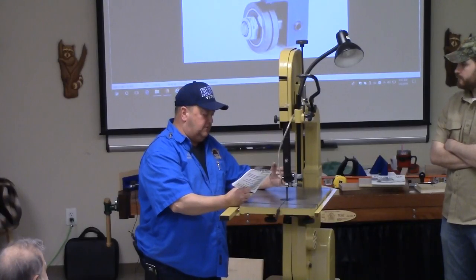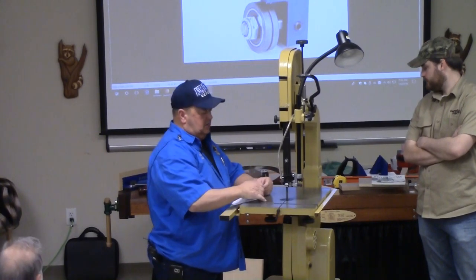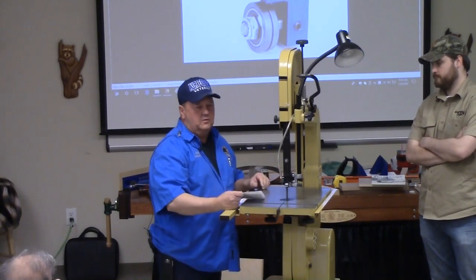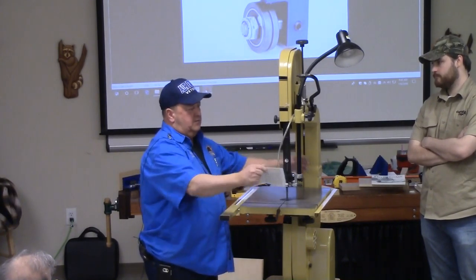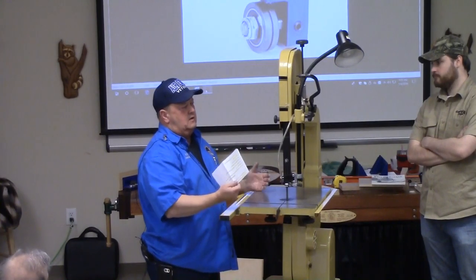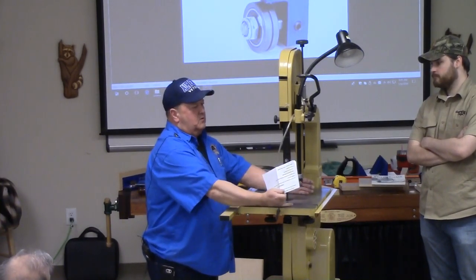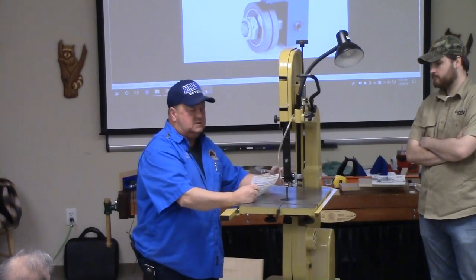For bandsaw safety, I use push sticks for everything. If I'm running something across there, like a 2x4 from the scrap wood I end up burning or giving to Hans, I don't care because it doesn't need to be straight or perfect, so I throw it away. But I make sure I'm controlling where I'm putting it across there. So you want to use a push stick.